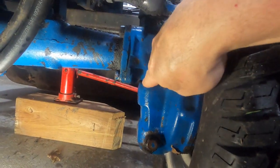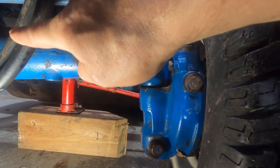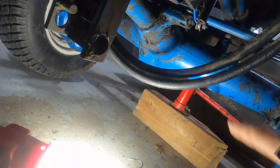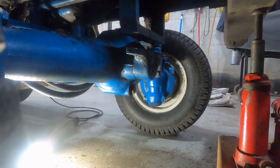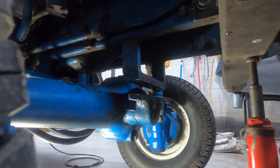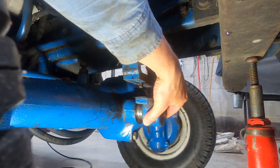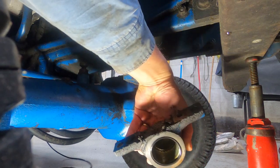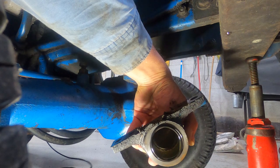When I was down here, I noticed I've got this seal as well. It looks like both of them are leaking - this one's worse. So I'm going to probably do that in a separate video. I think I'll just keep it with the bushings and O-rings for this video. So the next thing I'm going to do is pull the cup off the front. That cup should just come off - and it does, nice and simply. There's the O-ring and there's the bushing. That couldn't be any easier. I'll clean that up and I'll see about getting that new bushing in there.